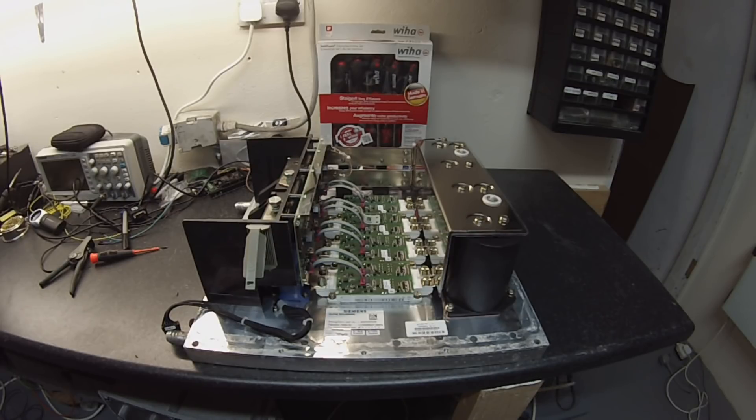What we've got here is some of the most beautiful power electronics I've ever seen. We've got four Infineon FF450R 12ME4 IGBT modules complete with gate drive. We've also got some huge LEM current sensors in there — the type that you see on their website that they recommend for rail traction applications.